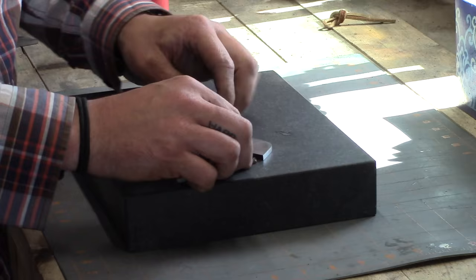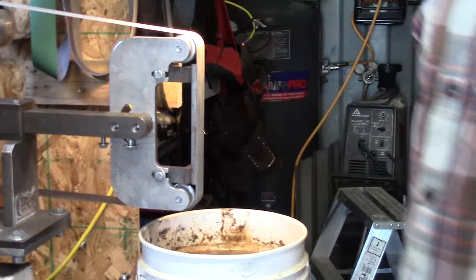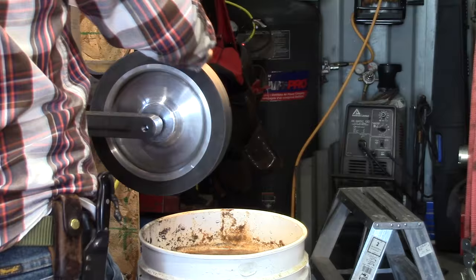I use a drill bit that is the same diameter as the material thickness and just scratch a couple of lines — that's going to be our grind line. You usually get two lines that are very close together, and that gives us the material we want to leave once we're done grinding. You don't want to grind it to a fine point first, as it could potentially warp during heat treat.